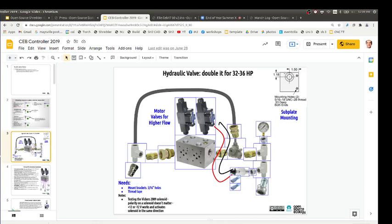They're full. Everything is full. The important point about the quick connects is they're not just quick connects, they are self-closing quick connects, because you can disconnect something and it's going to leak on you. These have ball valves with a spring. When it's connected the ball gets pushed in, and when you disconnect it, the ball goes against the seal, so you just get a little dribble of fluid. You do see a bunch of leaks around here. Every time you take these things apart, they do leak a few drops.